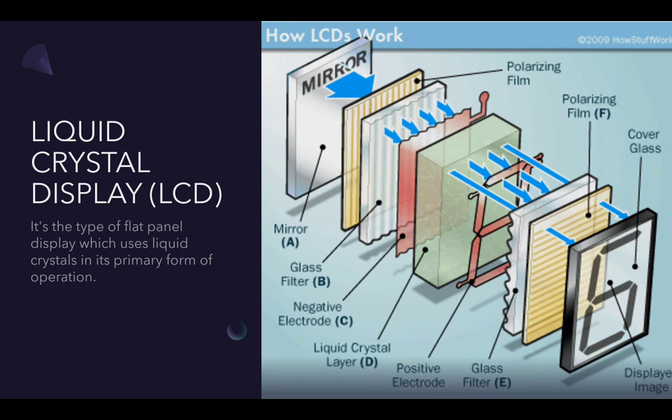The RS, E, D4, D5, D6, and D7 pins on the LCD can be connected to the other pins of Arduino. A 10 kilohm potentiometer should be connected between VEE and ground — this resistor is the LCD contrast adjustment. If the LCD characters do not appear, we need to find the correct resistance by turning the potentiometer adjustment bar. If the resistor is not connected, the characters will not appear on the LCD.